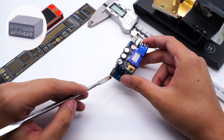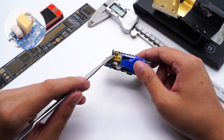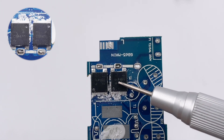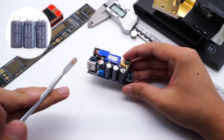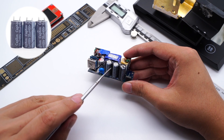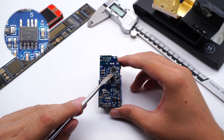The time-delay fuse is rated 250V 3.15A. There are two common-mode chokes and a safety X2 capacitor on the input PCB, along with four resistors. Two bridge rectifiers are placed around the front of the PCB to dissipate heat evenly. Three electrolytic capacitors for high-voltage filtering come from CapXon, rated 400V 33μF.